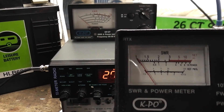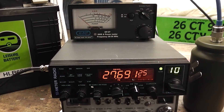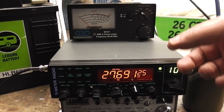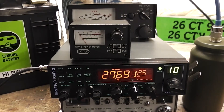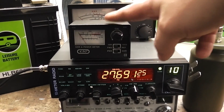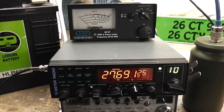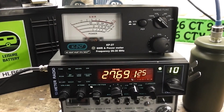It's a bit easier to tell what power is what when it's where it is. Just a quick one tonight to show you a couple of checks that the radios are doing what they're supposed to be doing, and mainly that homebrew dummy load - so have a go at some homebrew perhaps and see what your radios are actually putting out. The other thing with those smaller meters: if you're going to use them for power testing they're not so accurate. I did use one last night to check the Anytone and it told me it was putting out 50 watts, which was twaddle.